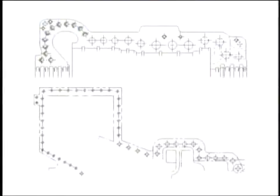If you are tightening a joint other than a circular flange, check with the OEM in case you need to tighten in a different sequence.